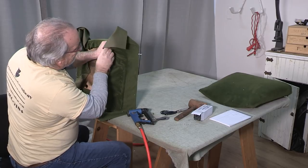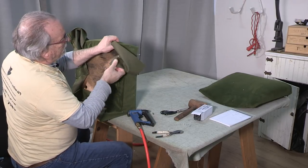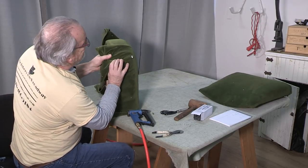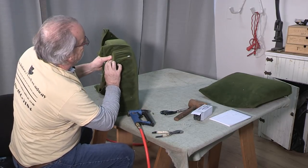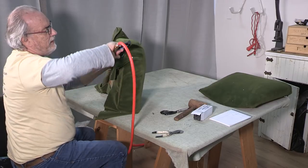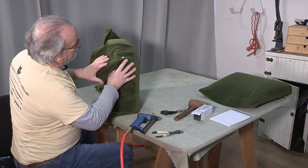Get in our middle. Already I see a problem staple, so I'm going to take that out. You need a little bit more room to work your pleats. If you've got a staple that wandered a little too far, it could be anywhere. So what I'm going to do here is take an even amount of both sides, and make sure this is as smooth as you can get it when you staple this. I'm not going to sideways staple like that, I'm not committing to it. It's a horizontal staple, just to give me a little more room to work, okay?